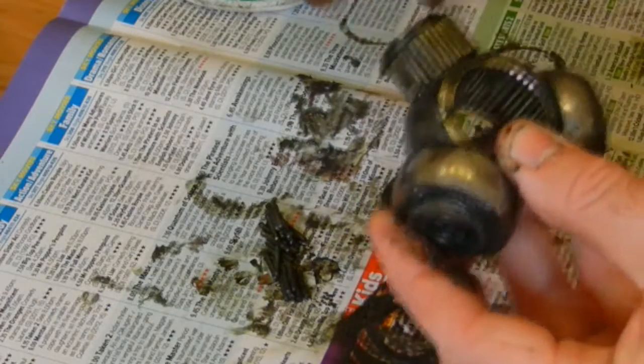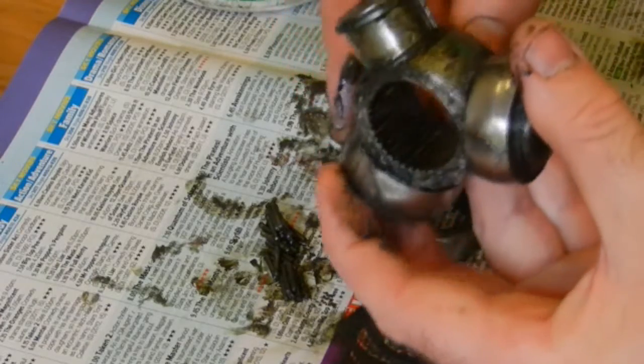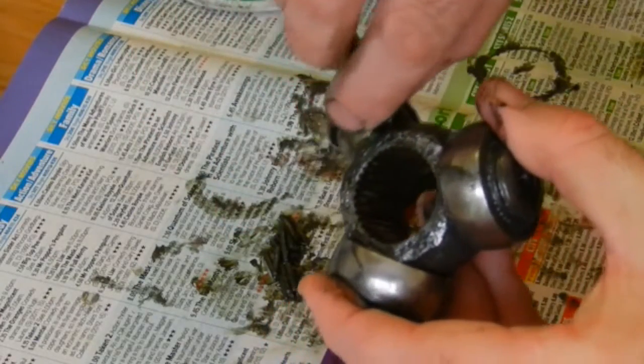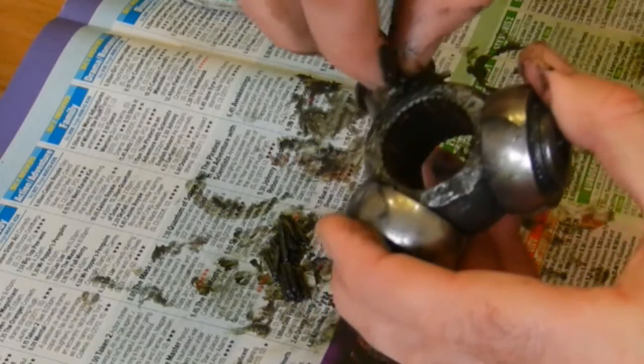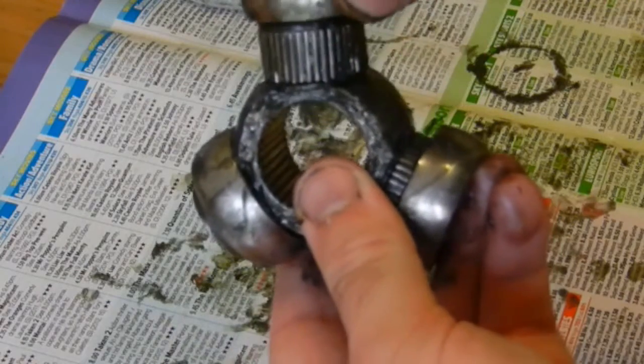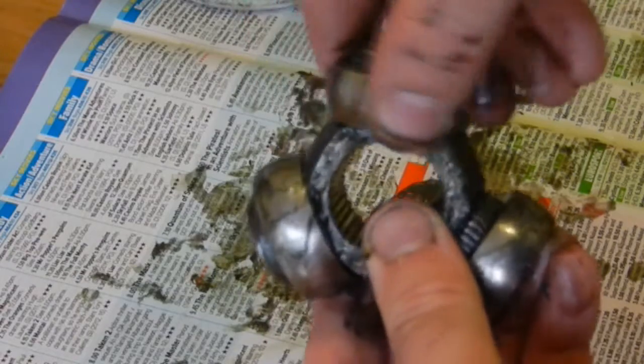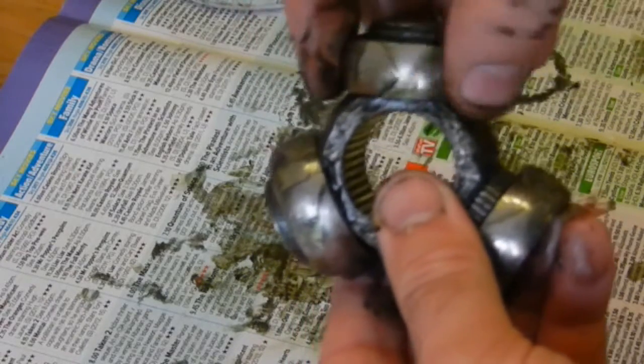Continue until you've put all the needles in place — there shouldn't be any gaps. If there's a gap that would take another needle, it means you're missing one. They should be completely surrounding the bearing surface and parallel. I've sped this bit up, but they should be parallel and flat. Then just gently place the cap over, give it a little twist to get the grease around it, and basically it's the same process for the other two.